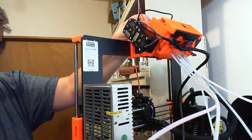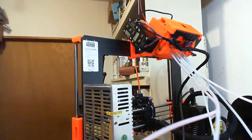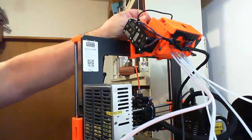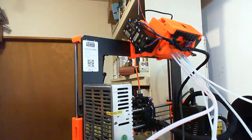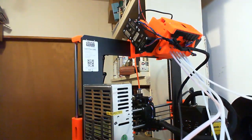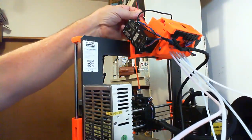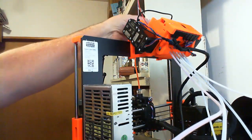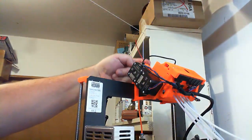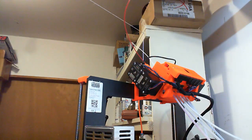And maybe this Bowden tube's pinched somehow in this little arm thing. I mean, it is tight. Let's see if I can push number 3 up through there. This is the white filament. So far I've been, now this one versus this one's about twice as hard. The red one, which is on channel number 5, is about twice as hard to pull. But you notice how this, can you see that? So this has a pretty good curl to the filament, and the white one is pretty straight.